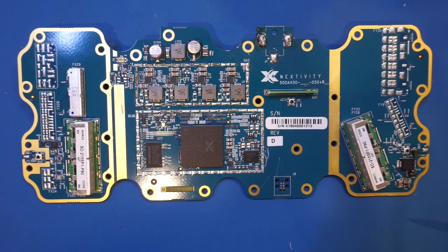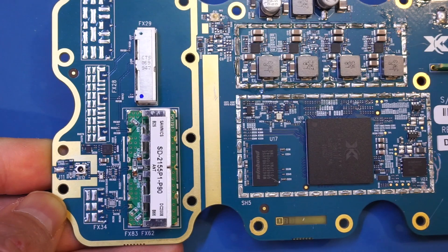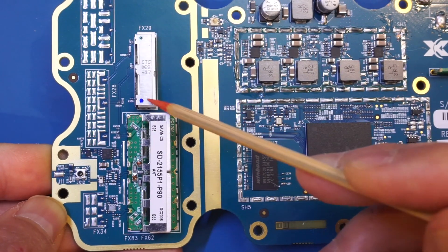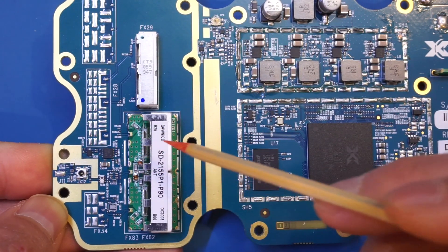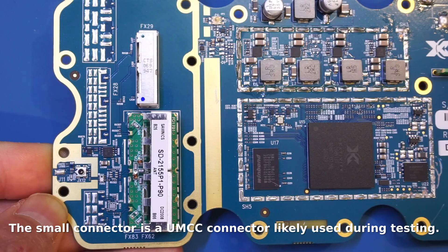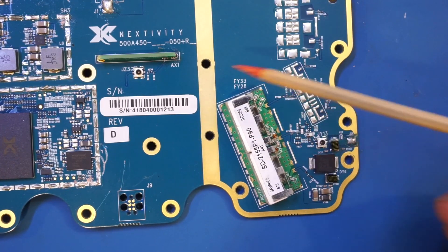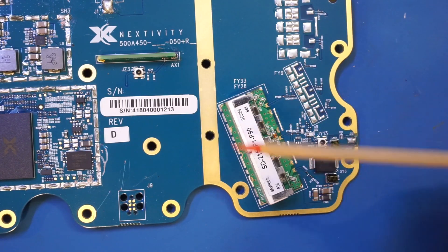What a duplexer does is allow the uplink and the downlink to share a single antenna. The cell tower side also has an additional RF SAW filter here, though I'm not entirely sure. There is also a chip along the signal path that could be a variable gain low noise amplifier for the front end, but without the actual diagram it's hard to tell its exact purpose. On the cell side we have pretty similar circuitry, except we do not have that amplifier chip or that SAW filter, but we do have a duplexer.